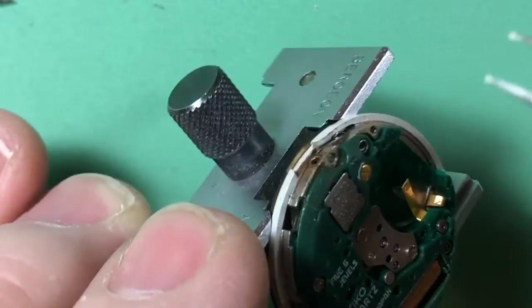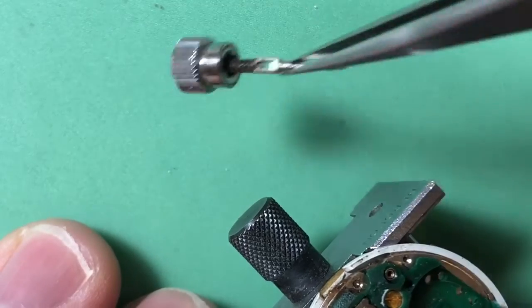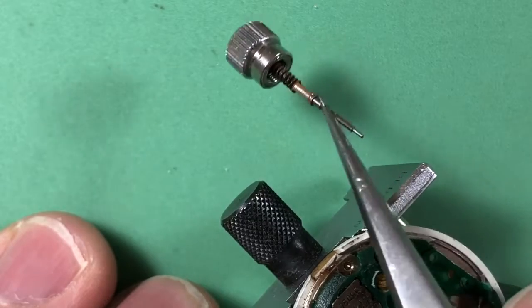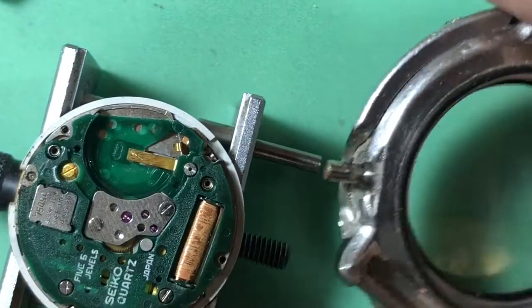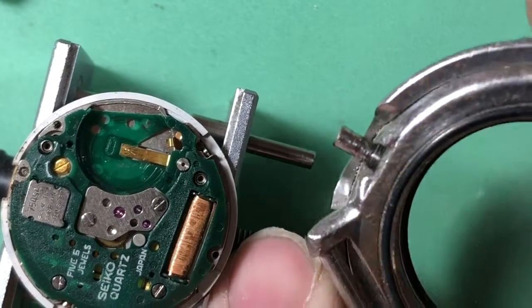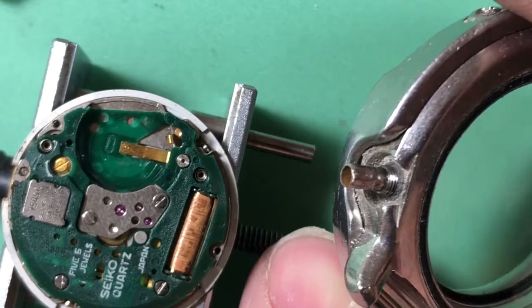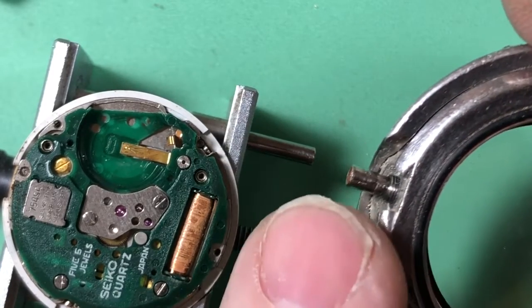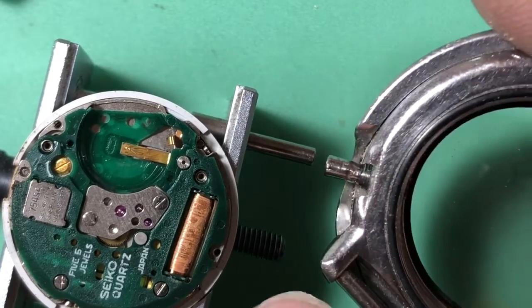The watch also had some corrosion inside here and some water that got in through the crown. You can actually see sort of a corrosion staining on the stem. Not a ton, but there it is. Also, a couple more things. You've got some dinks and dents and dunks in your crown tube, and we can see there's actually corrosion, rust, water inside the crown tube that got there. I'll do my best. I have some ways to sometimes free that up because that's right on the sealing surface. It's right where the seal sits.